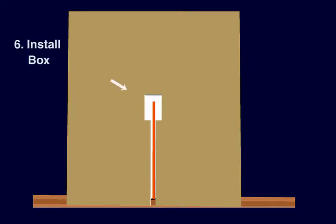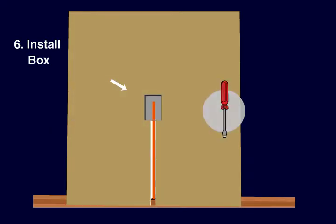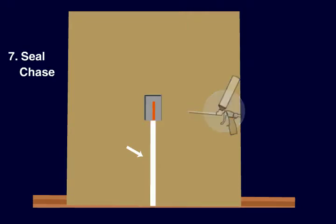When installing the electrical box itself, there are two options. If the box has flanges, fasten it mechanically to the surface of the OSB with screws. If not, the box is adhered in place with expandable adhesive foam. Finally, apply expandable foam over the vertical chase to hold the wire in place and prepare for wall finishing.